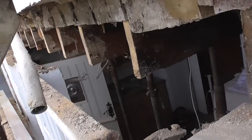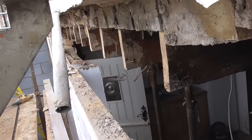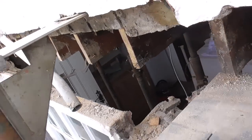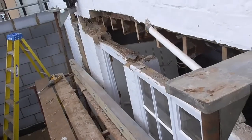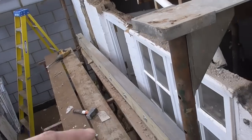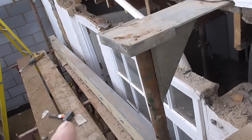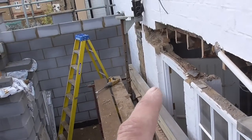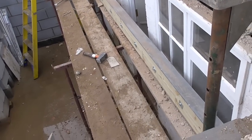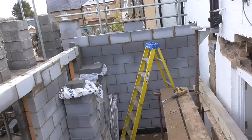So there you see — we've got all of those joists cut. They're straight-ish. I used a mixture of the little 160mm saw — I could get a little bit of some of them done — and the rest I just did with the multi-tool. So we're going to have a sandwich now, it's just before 10 o'clock. We've got that last little bit of brickwork to take out and then we can get that steel in and start getting these joists strapped to the back of it. Once that's done, we can lay the new joists in, mark out where the joist hangers want to go, and it should be fairly straightforward joisting this out.